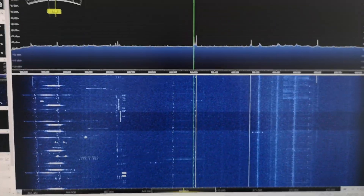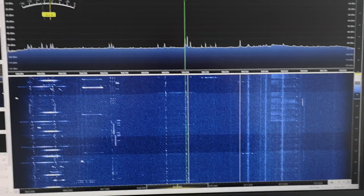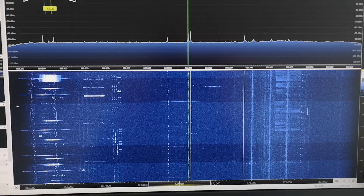Today I'm going to try to make a video about antennas and compare their performance just on receive — receiving a weak signal for MeshTastic 868 MHz. Just to show you what's happening on that band, the ISM band, 868 MHz. That's the receive spectrum received on an outdoor antenna that's not resonant at that frequency at all.